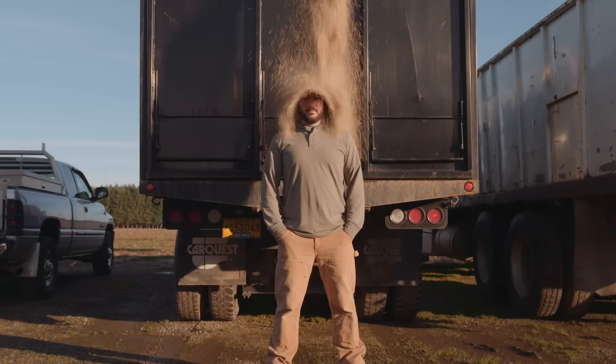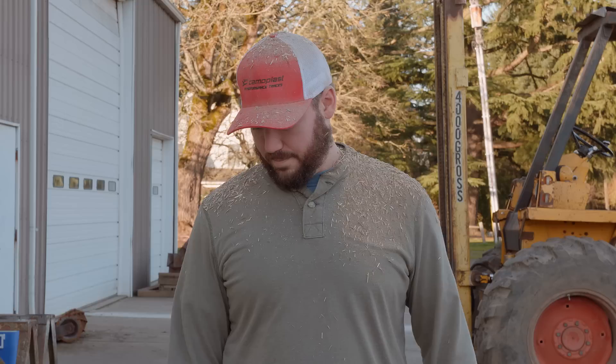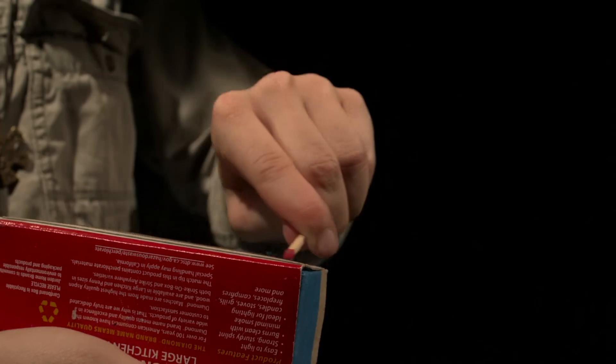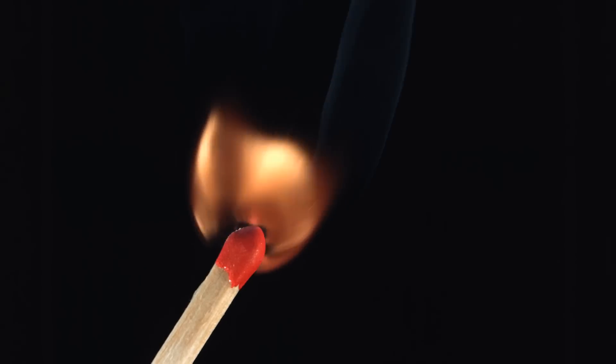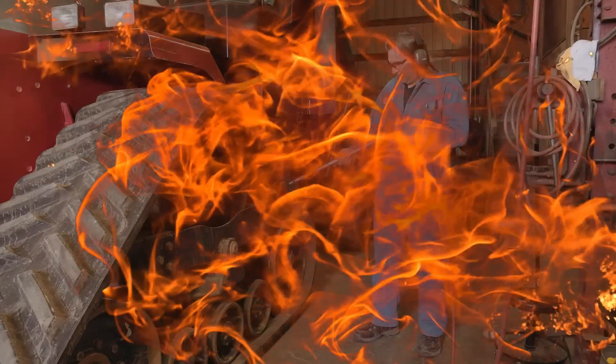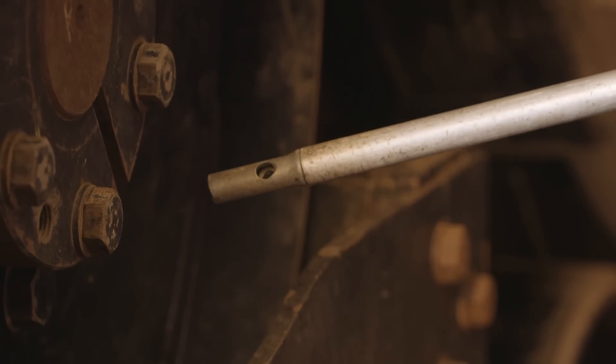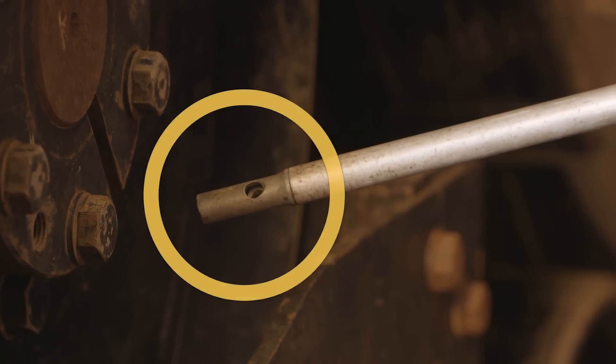Farming's dirty business. Using compressed air to clean your clothes? Bad idea. Believe it or not, compressed air can get under your skin and form a bubble that can travel to your brain and kill you. Recently blown clothing is also highly flammable. When you're working with compressed air, be sure to use an OSHA-approved nozzle with a built-in pressure reliever.